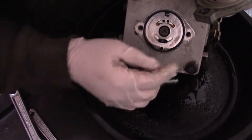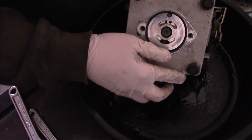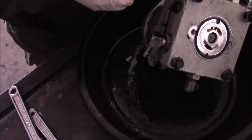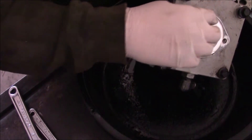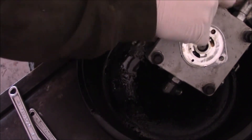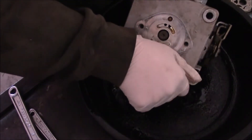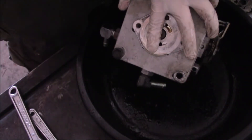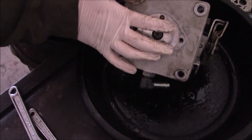The pump — and then there is a spring and a check ball right there on that side. We want to make sure we keep that together. So I'm going to go find that spring. That spring goes here, and the check ball. This O-ring goes here, and that check ball right there. Let's see what the rest of it looks like. These should all be about the same size — there shouldn't be any difference between the bypass and... Yep, they're all the same size bolts, as we thought.